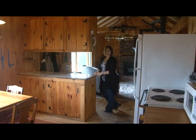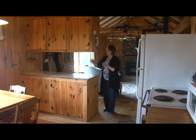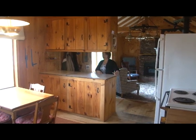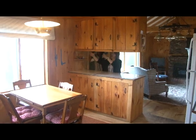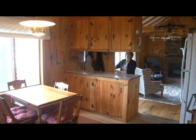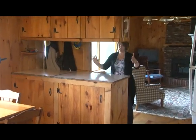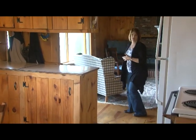From this angle you can see the connection of the kitchen to the living room. We are going to open this up. The bench area will be over here, this upper cabinet goes away, and the new opening will be here. The refrigerator will be here, and we determined that length based on the door that will most likely always be open when the cottage is being used in the summer. So this door defines where the refrigerator goes, and this is the opening that will be created connecting to the living room.